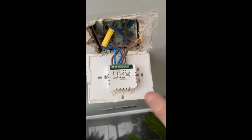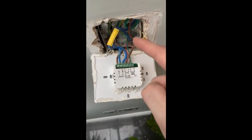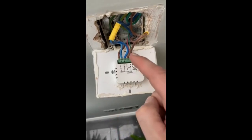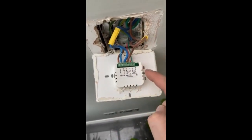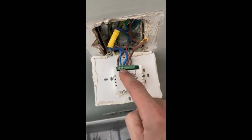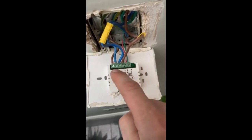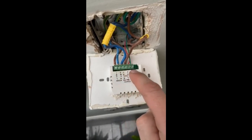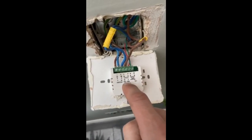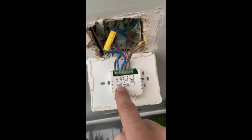I've taken the underfloor heating thermostat off the wall. As you can see, it comes through into a normal metal back box. There's a fused spur just down there which I've already switched off and isolated, then checked to confirm there is no power going through these terminals. Because you have quite a lot of cables going into this, there are six terminals — your underfloor heating sensor, the mat itself, and then the main power coming in.